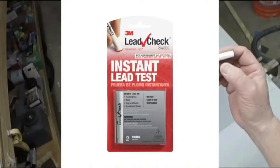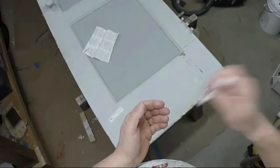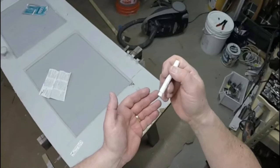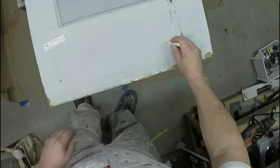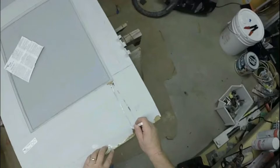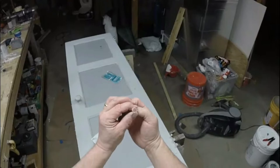I've got this little kit, and I'm going to crush either side of this. We're going to test and see if this does indeed contain lead. If it turns red, there's lead. We're testing for lead — if this tip is pink or red, then we know this paint has lead in it. Let's see what's happening here. Yeah, it's pink. This definitely contains lead-based paint.